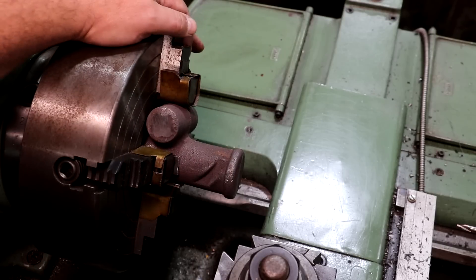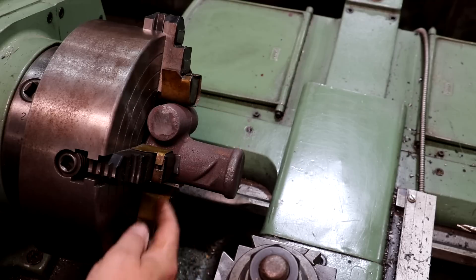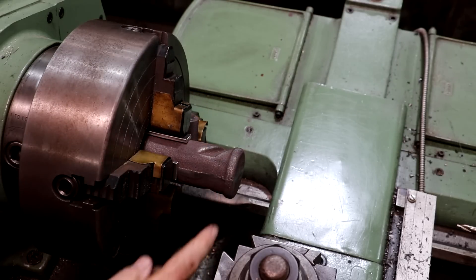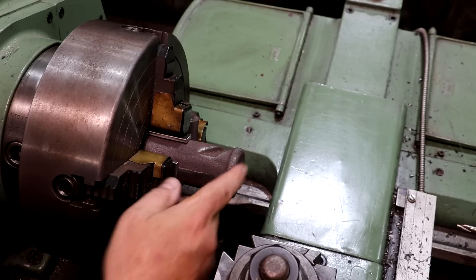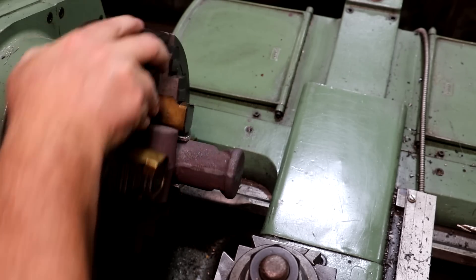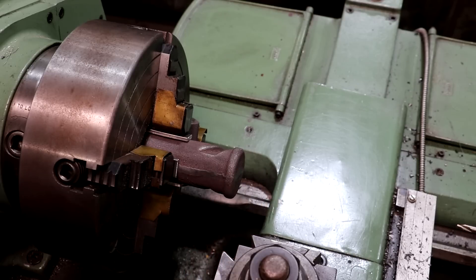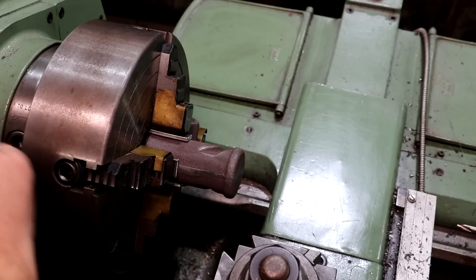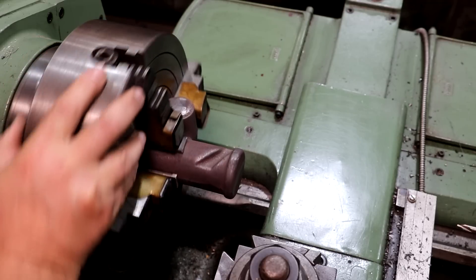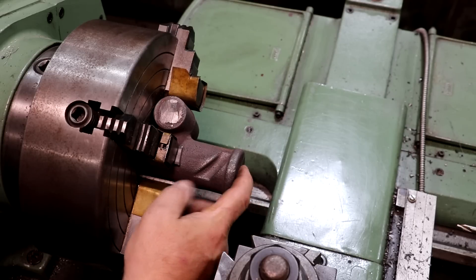So I'm over here at the lathe, and as you can see, I've got this mounted in the four-jaw chuck. It was kind of a tricky setup. We had to offset one side here obviously because of this piece here. And I also had to put some spacers in here, because in the back the jaws were hitting on this little raised edge. So I just put those in there and that cleared it just fine. It took me a little while to kind of get this thing running fairly true. Now keep in mind, this is a rough casting, so it's not a machined surface. It's going to have some runout, but I got it running pretty darn true through here, running all the way down through the center where I think it'll be just fine.